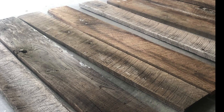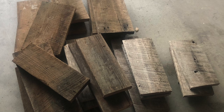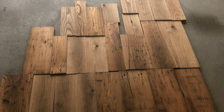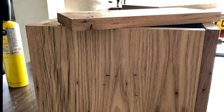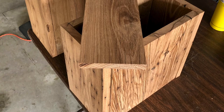This is a picture of how the boards started out. I cut them into pieces that were a minimum of 14 inches in length. The speaker height is 12 inches, so I made sure I had a little bit of margin. I ran them through a planer to get them flat and even. I used a jointer and a table saw to get everything squared up. The top, bottom, front, and back are one piece. They needed to be about six and a half inches wide for the front and back baffle, and the sides were 12 inches, so I had to glue some pieces together. It's really important to keep the pieces as flat as possible so when you glue everything together, there are no gaps in the joints. In this shot, you can see the pieces laid together — I haven't glued them up yet, but I just did a dry fit to make sure everything at least appeared correct.